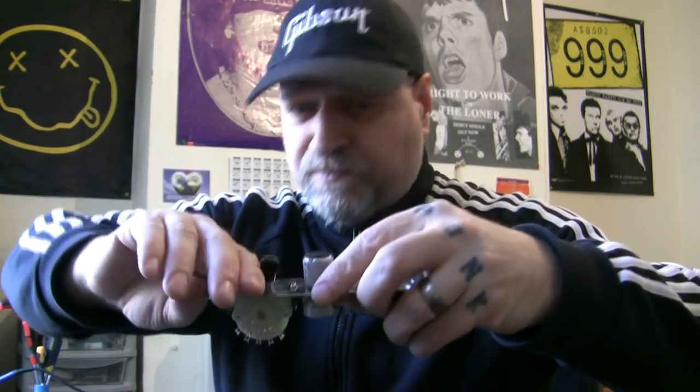Now, the way I've got the four-way in, and the way I wire this is quite different, because when we have a bridge pickup on its own, it tends to buzz a little bit, and what we have to do is separate the cover on the neck pickup, the ground. We have to ground it separately from the actual ground on the pickup. You've got one hot wire and one common wire on a pickup, and we normally ground the metal case of a Telecaster neck pickup with the common or the ground on the pickup. We're not going to do it, we're going to separate them. They need to be split, and it stops the buzzing on the bridge pickup. So I'm going to have to do that. So it's, again, a special kind of wiring.